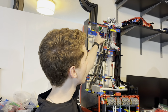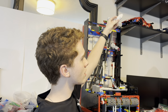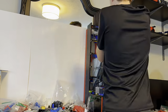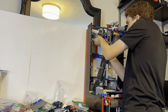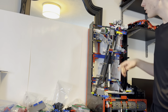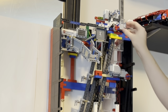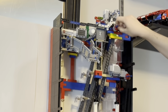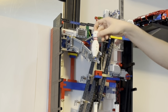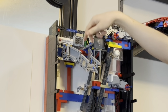Now that we have the pins able to be taken up and oriented correctly, we need them to roll down this way, turn, and head the other way so they can go into the pin setter, which we'll build in our next episode. What seemed very simple ended up taking a lot of testing — I tried different methods including separate channels for differently-oriented pins, but they didn't work. We are finally done with the hopper that adjusts the pins to the correct orientation. Now a pin placed either way onto the conveyor belt gets spun and lands in the correct orientation to stand upright.